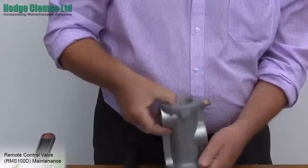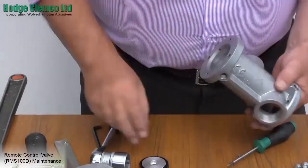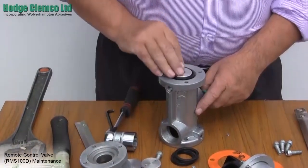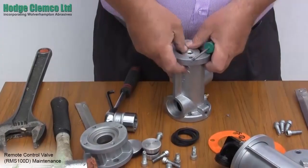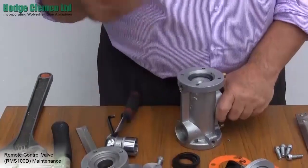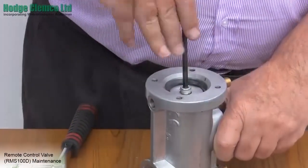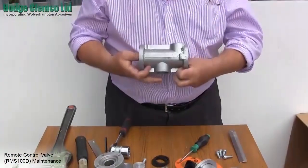To reassemble, put all new O-rings on the piston. Slide the piston in and brace it through the hole with a screwdriver and replace the sleeve. Using one of the 16mm socket head cap screws, tighten it while checking the cup seal is not pinched in any way. Check the inlet piston using your thumbs — it should move freely within the valve.